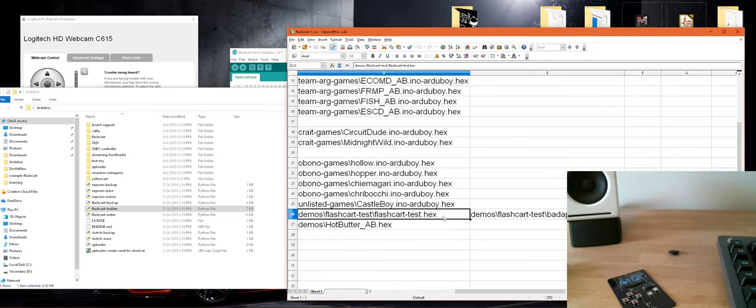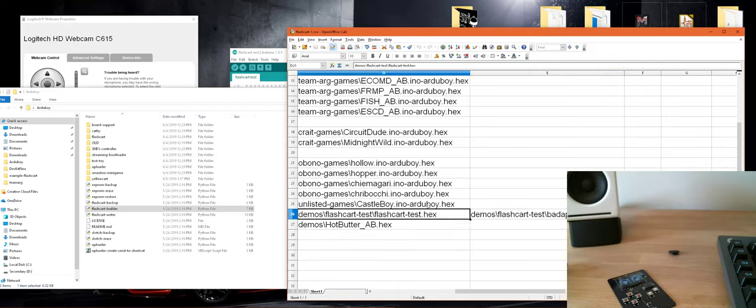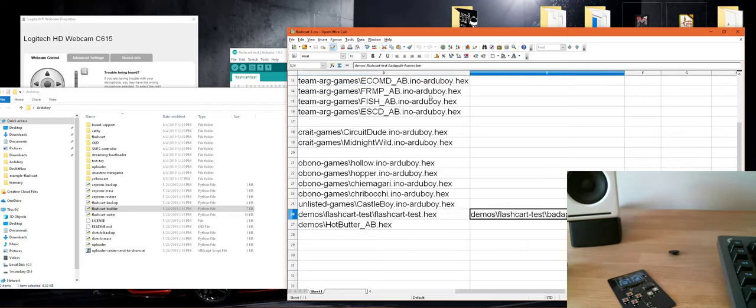And then it actually modifies the values within the hex to change that memory location to an arbitrary setting that you choose at compile time, to wherever this tool ends up storing this. So it's actually modifying hex files as it goes in order to move them to the location where they're at now. That's the real trick of how this all comes together. Otherwise, it's just sequentially loading in the data, but it's doing more than that. It's actually modifying the hex files to tell them where the external memory is.